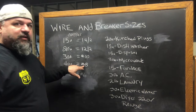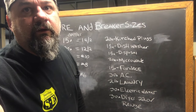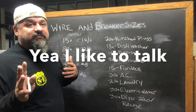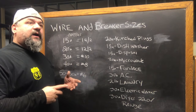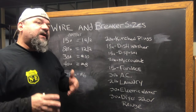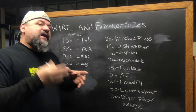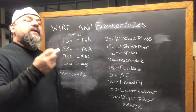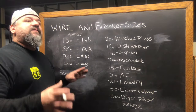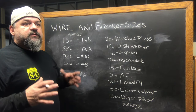That's why I didn't put 8-2 — that's number 8. A neutral would be used like in a stove. Number 8, you can have three wire because you might have a neutral in something. Back in the day, the stoves — if you had a range — didn't require a neutral. Just two hots for that filament to heat up in the stove, and you didn't have a neutral, no electronics. Now, because you have electronics, there's a transformer in there that reduces the voltage down. That's when you need a neutral — that, and for a dryer, is when you need a neutral.